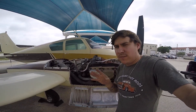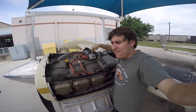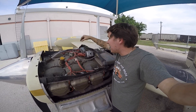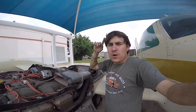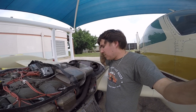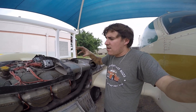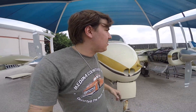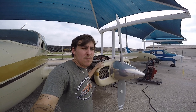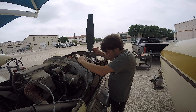I had the exact same issue on the Cessna 150 the other day. The left magneto is no good — it's not firing. We connected the P-lead, shut the P-lead off, and nothing is happening, so I know this magneto is bad. In order to get it to run we had to disconnect the P-leads because this magneto is grounding through the switch. While it was running, I was running on just the right mag. I'm having a bit of an issue starting it — fuel pressures are off, and the mixture rise is about 200 RPM, which isn't terrible but tells me they're close but off. Next time I start it I'm going to see if I can start it with just a primer.